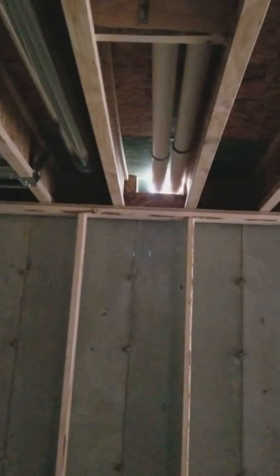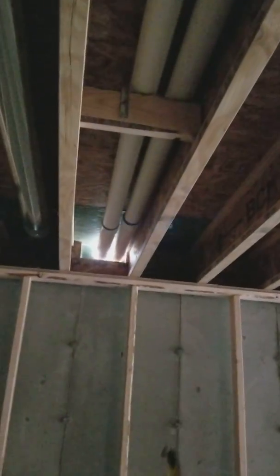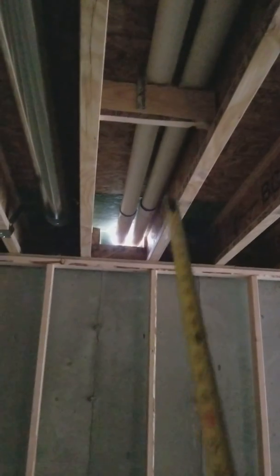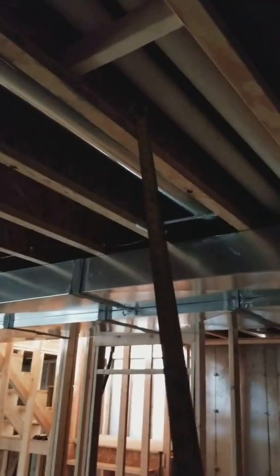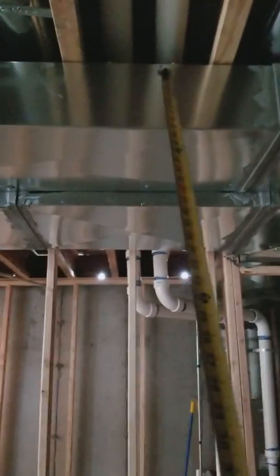Rule number two is slope. You need to make sure you always have a quarter inch of slope per foot. The most convenient way to do this is to start with a 2x6. You also need to make sure that you secure your pipes at least every six feet. I like to start with a standing 2x6, followed by a standing 2x4, and next — you can't see past the duct here — but it's a 2x4 that's laying down.